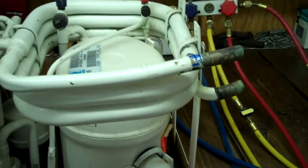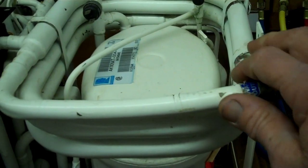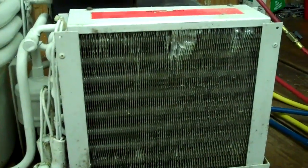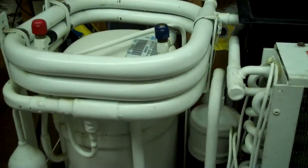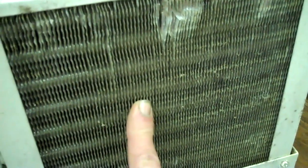This unit out of a boat is the exact same thing minus the ability to heat water. Instead of having an outside unit, you have a heat exchanger — basically a pipe inside of a pipe. Whether it's in reverse or straight ahead, it's going to turn the gas into a liquid and dissipate the heat through water circulating around it. In cooling mode this is called the condenser, and the evaporator blows cold air — actually removes heat from your house. In heat mode this becomes the evaporator and the water removes the coolness, while this becomes the condenser and blows very hot air into the house.